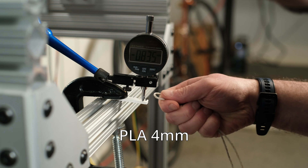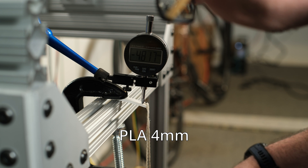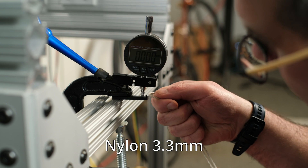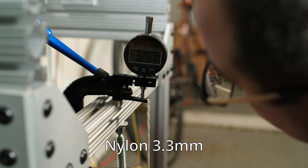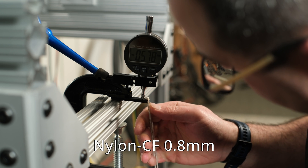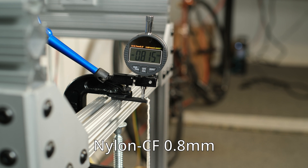Let's go back to the whole carbon fiber nylon. You better go test it when it shows up — which I'm not completely done with, but it's in process. Just doing some in-hand tests, it looks pretty good. Looking at the spec sheets, it's certainly an order of magnitude down in stiffness from aluminum. But the yield failure point shouldn't be that different — it'll be like a very weak cast aluminum.